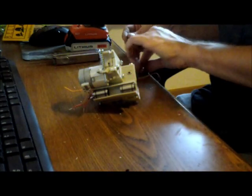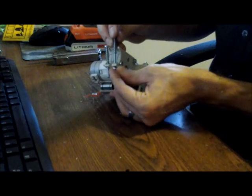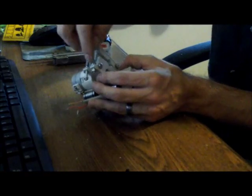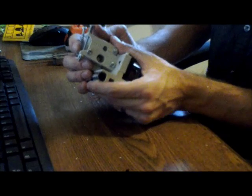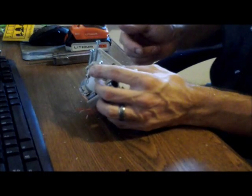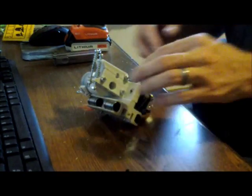Right now I don't have the drive or the pinch wheel, and I do not have the little piece or bar to attach the 608 or 624 — basically to attach the drive bearing. So for now I'm just going to use them at stock length. As you can see they kind of slide in this way, and then as you press the spring they slide into there, and to release you can just press up. They're really tight right now, so what I might do is either go to longer screws or just cut some of the coils out of the spring — longer screws might just be the easier thing to do, give me more play there.